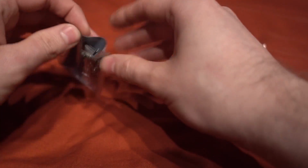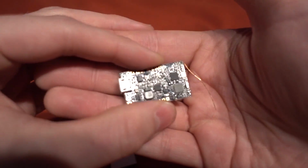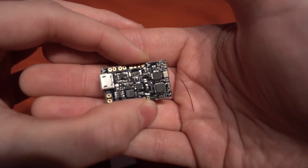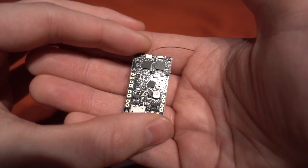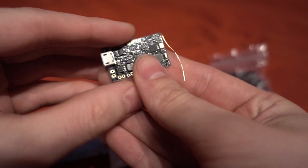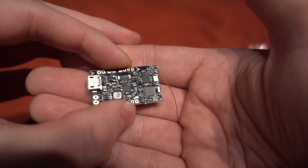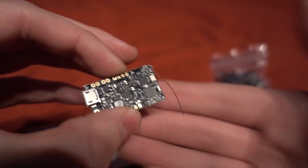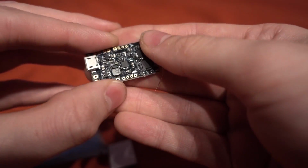And then we have the flight controller over here, and this is a fantastic update to the F3 Evo brushed flight controller. Alex again advised me of this flight controller. So it's got a built-in FrSky receiver which works in D8 mode, and they also have a FlySky version as well. This is going to save a lot of time and also weight as well, importantly.